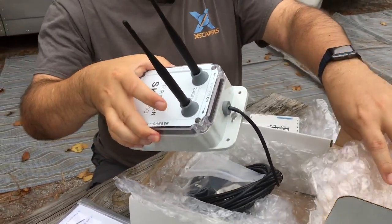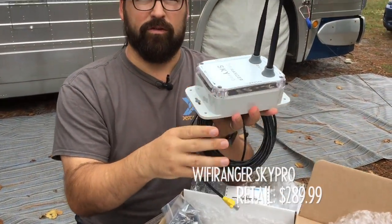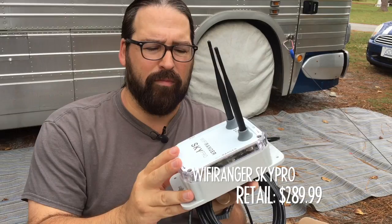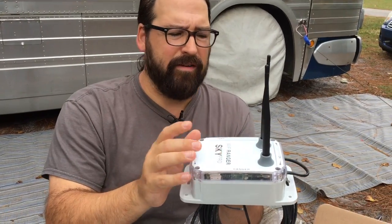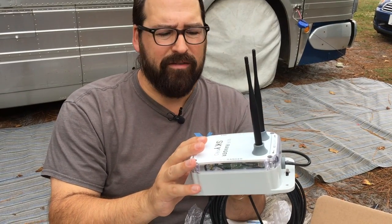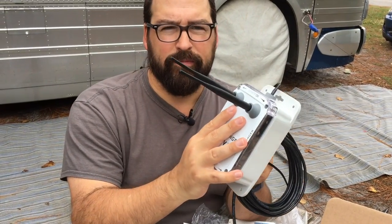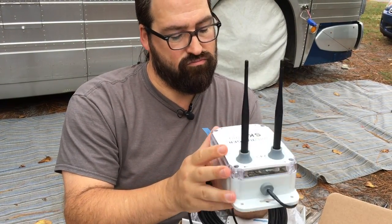And then the roof piece — this is the SkyPro. This is their middle-of-the-line product for what goes on the roof. They have the Sky 2, which is an older product that physically looks very similar but has just a single antenna. Single antenna means it is using only one antenna for MIMO. Wi-Fi, just like LTE, really likes to have multiple antennas and can take real advantage of them. So this is dual-chain Wi-Fi — you can combine double speeds using two antennas.